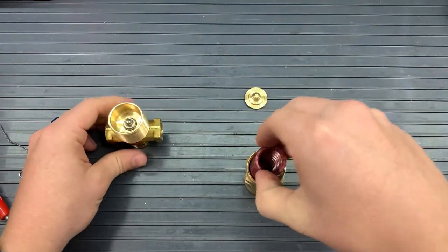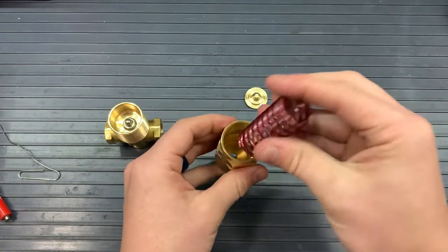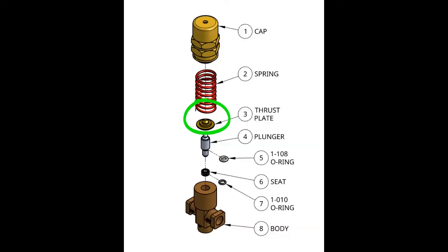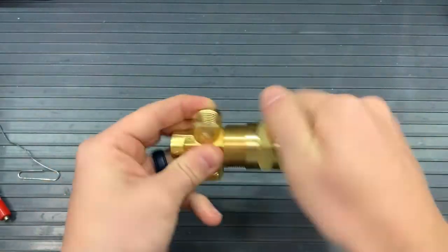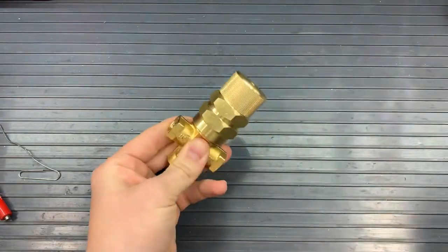This is the time where you would put washers into the cap if you have them — I would not recommend just adding washers for the fun of it. So with my spring down into my cap and the thrust plate resting on the spring with the pointed center going into the spring, I will turn my regulator seat, plunger, and O-ring combo onto that cap and slowly twist by hand.